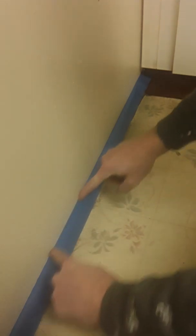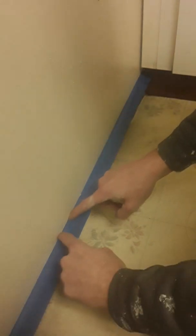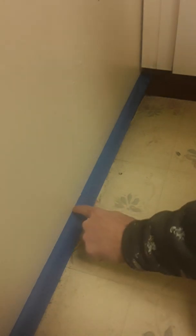I applied more paint than usual, but you don't apply a lot of paint. You just use the tape as a guide. It's a guideline, and it's only there for safety precautions if you happen to nick it. You can run it a little bit on there, but you don't want to run it much. You could get underbleed, and when you pull your tape, instead of a perfect straight line, you'll have a dab like that.